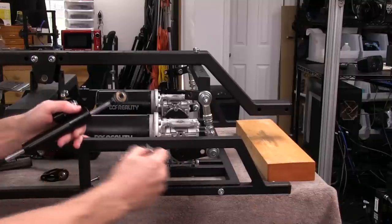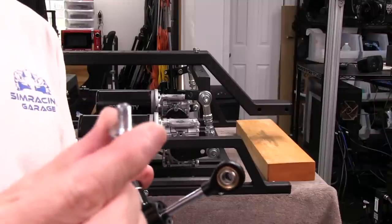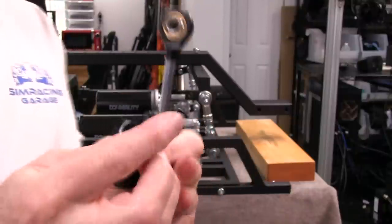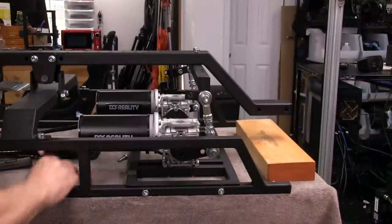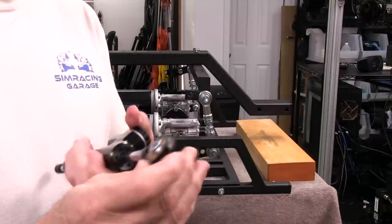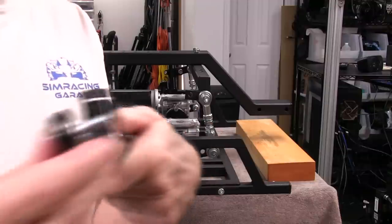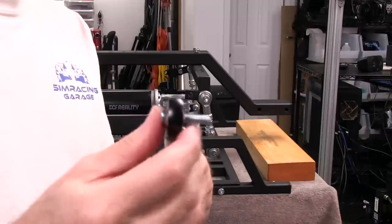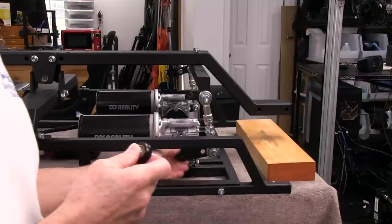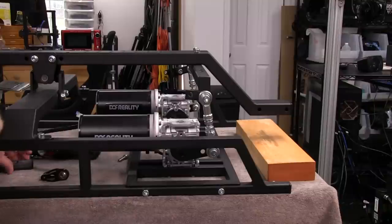And it's not a very long screw, even though the hole in here, I've already checked, is longer. So you can see it's a pretty short looking M6 screw here. It's got a big flange on it. But I was able to source these flathead Phillips that are also M6 that will fit right in there. And because it's a flathead, it won't go through, right? And we still have enough thread on the other side here to go inside the hollow part of this gear shaft that's coming out of the motor, and just attach it. Very simple, really. So we'll go ahead and do that.